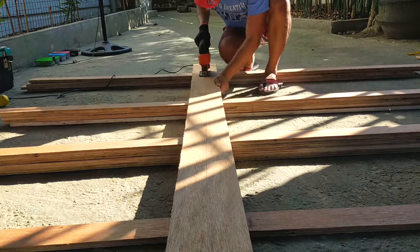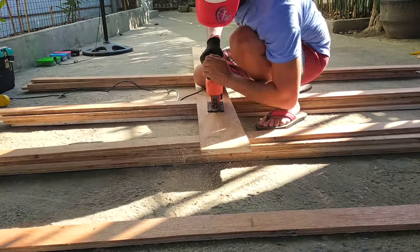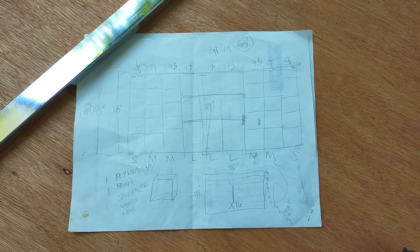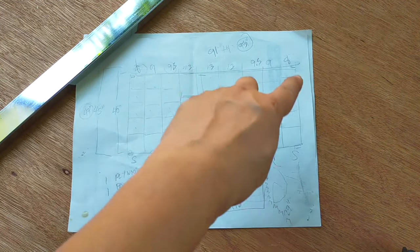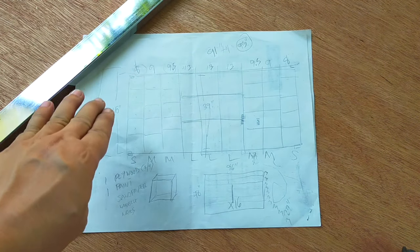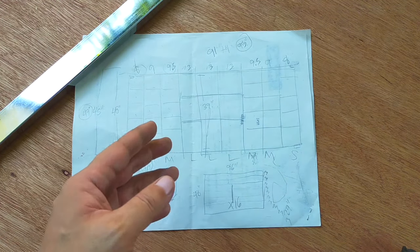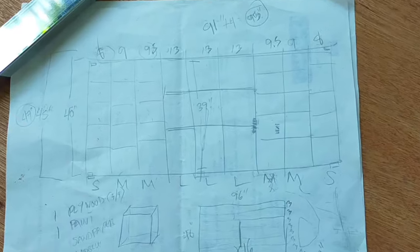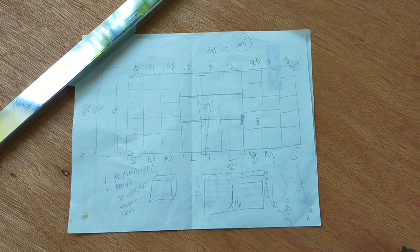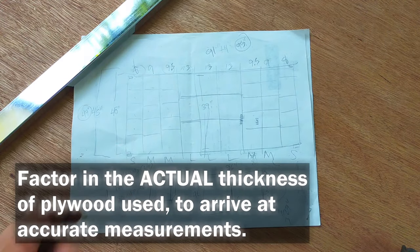If you have a good design or plan, you've already accomplished half the project — the other half is just executing the plan. I was lucky because my mother-in-law had a very clear vision of what her collectible plate shelf should look like. When we arrived, the first thing she showed me was her design drawn in her notebook, complete with the number of compartments and measurements. She knew the exact number of plates along with their respective diameters, and we grouped them into small, medium, and large — placing the smallest plates at the far ends, the largest at the center, and the medium ones in between. She even anticipated allowance in the middle to potentially expand from a three-by-three grid into a four-by-four grid. All I had to do was copy her design at scale and make minor adjustments to factor in the actual thickness of the plywood with respect to the spacing of each compartment.